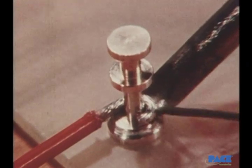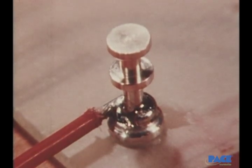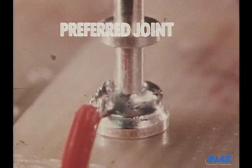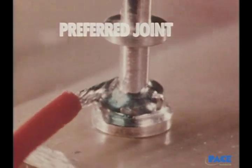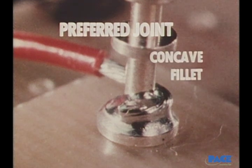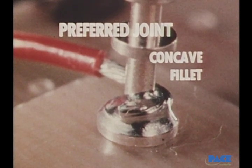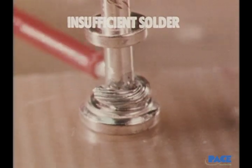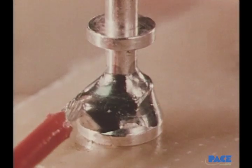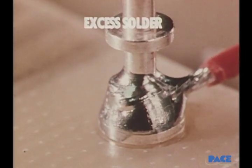Now we see it in real time again with just the right amount of solder going on. A good solder joint is bright and shiny, with the solder feathered out smoothly showing good wetting action along all elements of the joint. The area on the side is known as a fillet, and on a good joint the fillet is always slightly concave. A joint with too little solder is unacceptable — there's insufficient mechanical strength. Also unacceptable is a joint with excess solder, where the fillets are convex and the outline of the wire is hidden in a mound of solder.